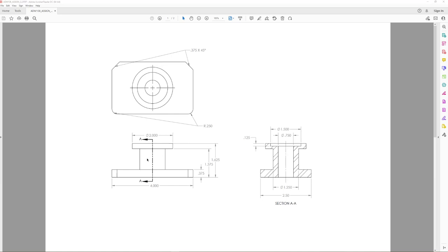Then our next level would be this shaft right here. We need to know the height of that particular shaft, which is 1.375 from the bottom surface. We've already got 0.375, so we're going to type 1.375 minus 0.375, which should be one — but we'll verify that later in the model. The diameter of this shaft is 1.25 inches, which we can see from the right side view with the diameter symbol. So that's a 1.25-inch diameter circle that we extrude out one inch from that surface.